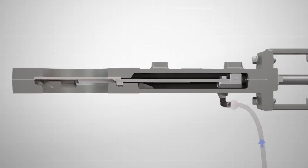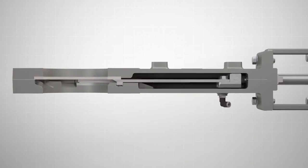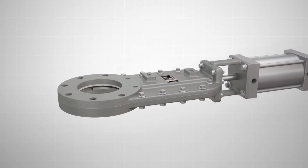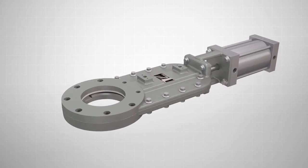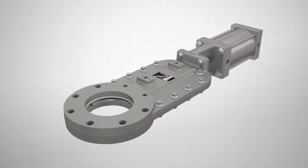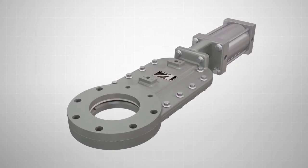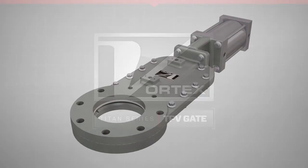The TPV's air purge system is essential for higher pressure applications, keeping materials in the flow stream. With minimal maintenance required and a number of replaceable elements, the Vortex TPV slide gate is a durable valve with a long service life. It is designed specifically for use with the most abrasive materials, both at high pressures and high temperatures, and its thin profile makes it a viable alternative to a butterfly valve or bullnose knife gate.